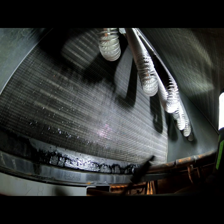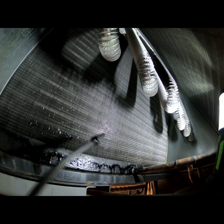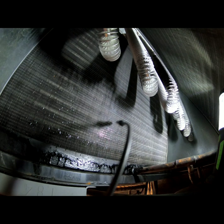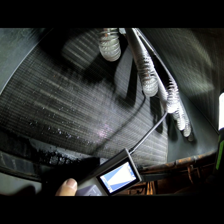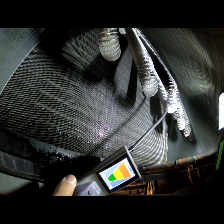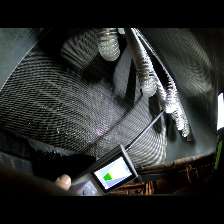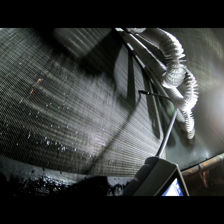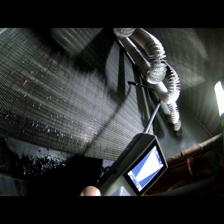I've moved over to the GoPro so you guys can see the whole picture a little bit better. There we go — we just pinpointed the leak, right there, basically right beside the shadow of that reheat coil. With copper becoming porous — meaning that refrigerant leaks right through the walls of the copper because it becomes so thin — this leak detector did very well in both cloud hunting and pinpoint mode.